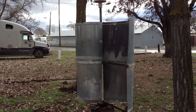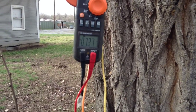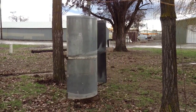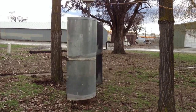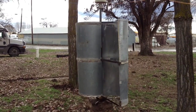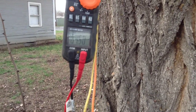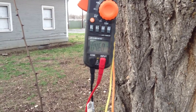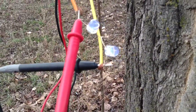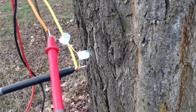Later on in an hour or two, we're supposed to pick up to about 15 mile per hour winds, and at 15 miles per hour we should reach an open circuit voltage of around 18 to 20 volts. This vertical axis wind turbine will start rotating at about three to four miles per hour. Right now she's spinning kind of slow, so we're probably running about four mile per hour wind, giving us a voltage of almost five — four and a half. I put two LEDs in series here so I don't blow them — it takes about five volts to kick these on and they should be safe up to about seven or eight volts.